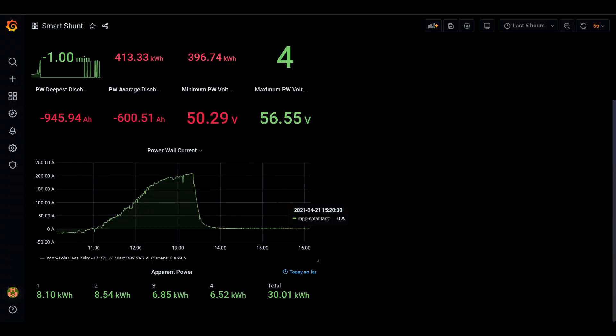What we are looking at right now is data from a smart shunt. It shows that the battery is fully charged and has been charged since about 1:30 o'clock. I'm showing you this so that later, when we look at the different graphs, we will put everything in perspective. The battery is at 100% state of charge, and now let's look at the fun numbers to give a better perspective of how the MPPT charge controllers on LV6548s work.